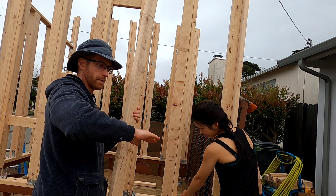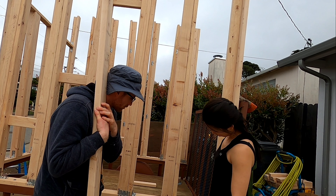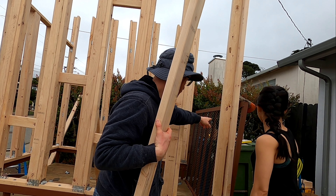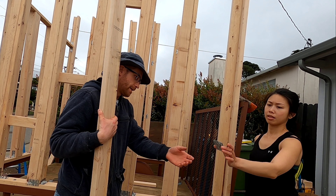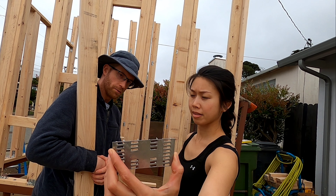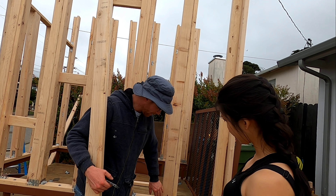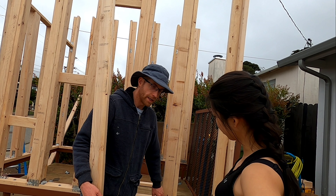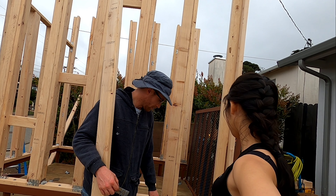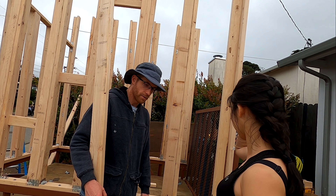What's this called? That's a mending plate. They use them in framing construction, particularly for roof trusses. It's one extra layer that holds everything together. It's like a plate of nails — you put it across the boards you want to hold together and whack it hard with a hammer, and it drives the nails in. It helps cinch everything together and helps all the boards act as one. The closest equivalent would be like a weld — not nearly as strong, but it helps this whole board behave as one with the other braces, adding another layer of support.